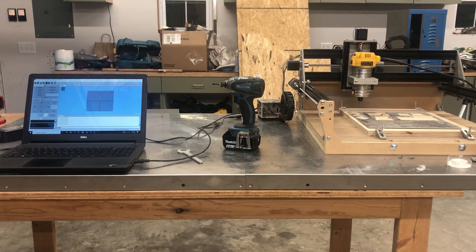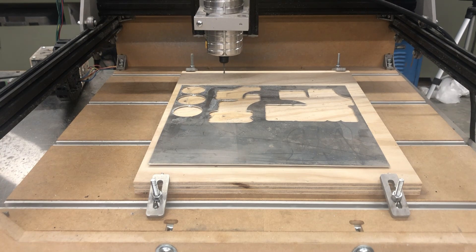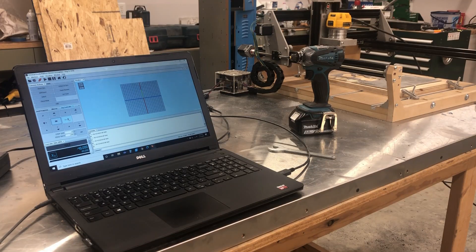Remember that you don't always have to go through the trouble of making G-code. Sometimes you can just use your CNC as if it were a normal mill. If all I'm doing is cutting a rectangle or a square out of my material, making G-code would take a long time, so instead I can just turn on my spindle, set the proper feed rate, and simply jog the machine to do the cutting for me — no G-code required. It can be difficult to determine proper feed rate and cut depth for a hobbyist level machine since most calculators are geared towards true robust machines. My advice is to just do it experimentally — set up your material, turn on your spindle, move to a conservative depth of cut and a conservative feed rate, and just see if it works. If it does, bump it up a little bit until you're uncomfortable.